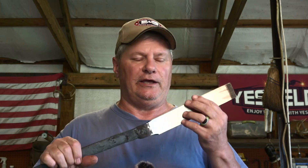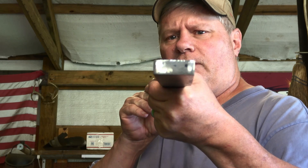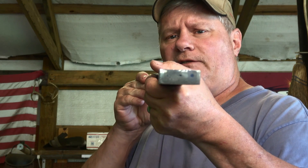I've got the bar to the thickness of one, drawn it out and cleaned all the scale off. I've also etched the end of the bar to make sure I've got a good clean end, because this is going to be the very end of the knife. You notice there are some bright spots where I've etched it - that has to come out of there. That's cross-contamination from when I TIG'd the ends - either got some filler material in there or cross-contamination. It looks like 15N20 that just blended in. So I'm just going to keep grinding and testing it until that's all gone, then I will have my final billet.